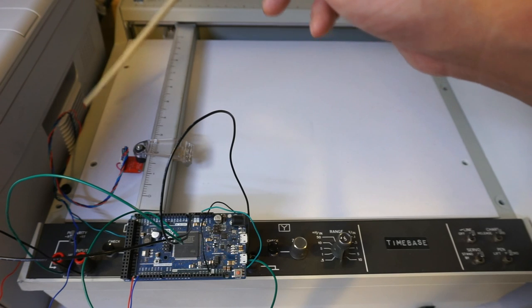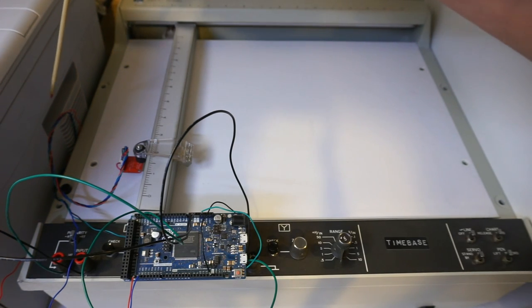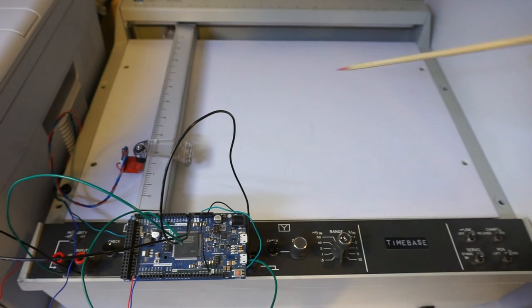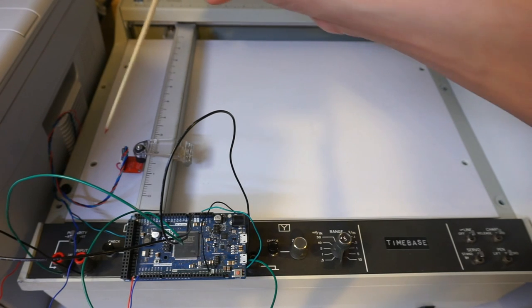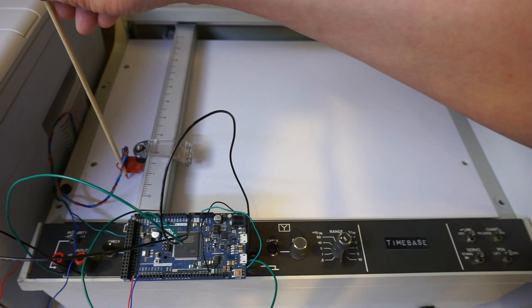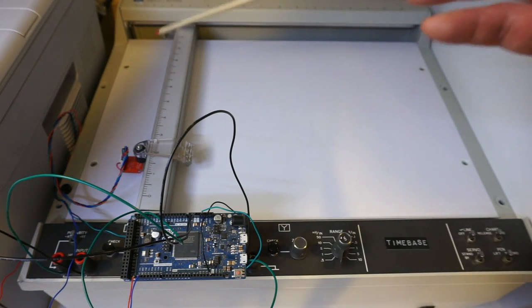But I don't think I can get it too close either. As the only light source on the board is a white LED, it wouldn't be able to illuminate the area the sensor is looking at if the distance is too close. So right now this is about 4 or 5 millimeters. I think that's pretty much the closest I can get.